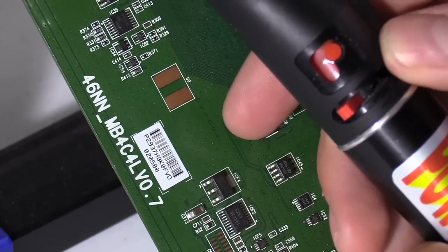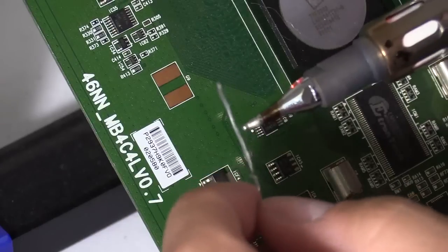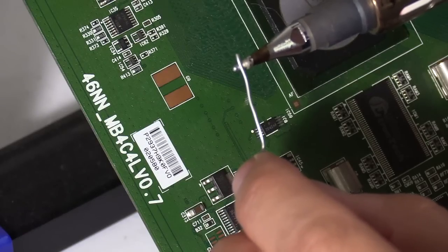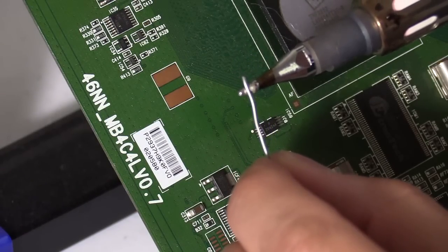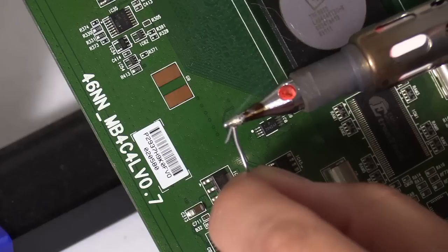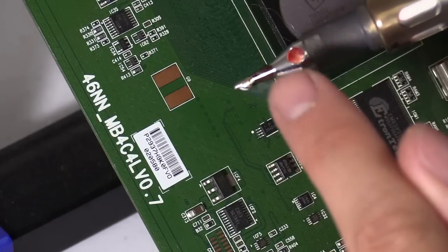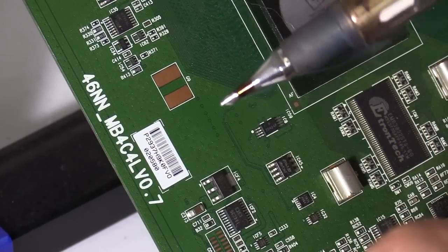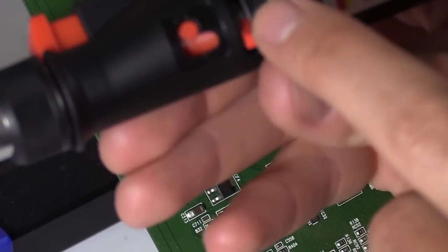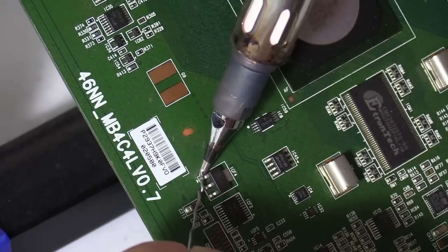We're going to leave it on low setting. Turn it on, press that trigger and it works. You can see how fast it heats up. It takes a little bit longer than the electric portable one but it's still kind of fast. This hole that you see right here you want to always make sure that's facing up because if you have it facing down it's going to scorch the board. So make sure this is facing upward. I like to have it on low setting because this thing is really powerful. Then once you tap that you want to go ahead and apply the solder to the joint.